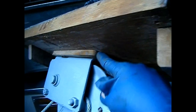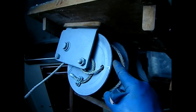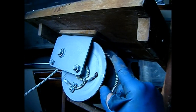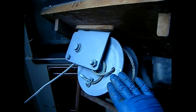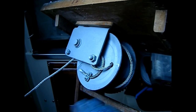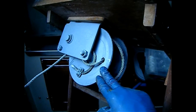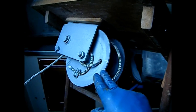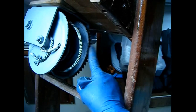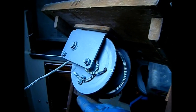If you take your winch off you'll see there's an angled shim so the cable is at the correct angle going through the tube down to the keel. You really want to make sure this winch is operating properly — if it fails the keel will drop and could potentially crack the hull. You cannot replace this with a standard boat winch; there are warnings all over the forums and on Catalina Direct. This winch has an internal braking system that controls the rate the keel lowers and a ratcheting mechanism for raising. Do not replace it with anything not specifically designed to raise and lower the keel of your Catalina.